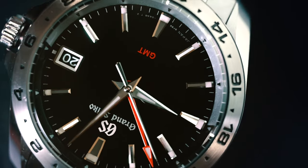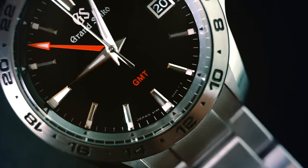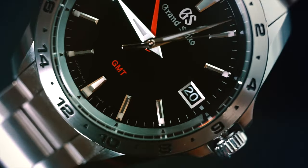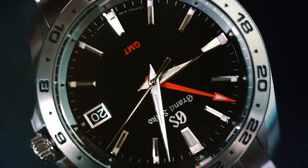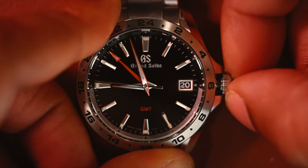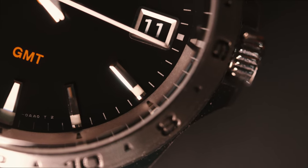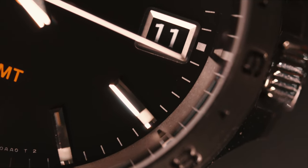The convenience of having a high-accuracy quartz timepiece in an extensive watch collection is very appealing. This movement also features an instant date change, which is significant for quartz watches. Most watches slowly advance the date once the time passes 7 p.m. According to Grand Seiko, the 9F quartz movement utilizes a cam and lever in conjunction with the date indicator driving wheel as part of a feature known as the instant date change mechanism. The date indicator driving wheel builds tension and the lever springs as it rotates, eventually releasing the stored energy and driving the calendar wheel forward in the blink of an eye. Grand Seiko was the first to pioneer this mechanism in a quartz movement.